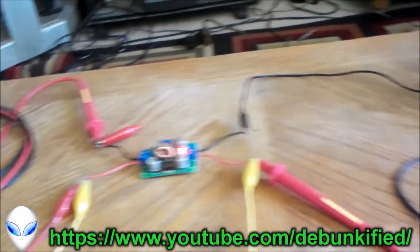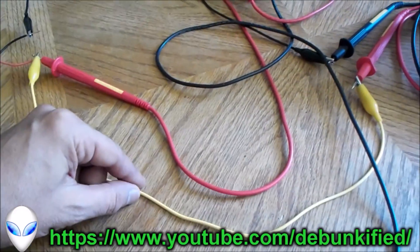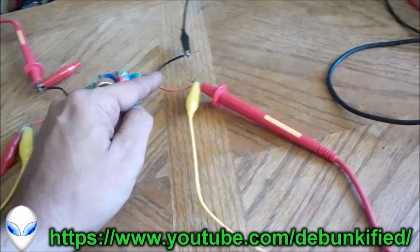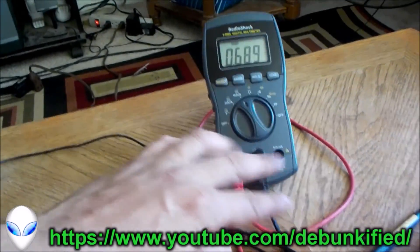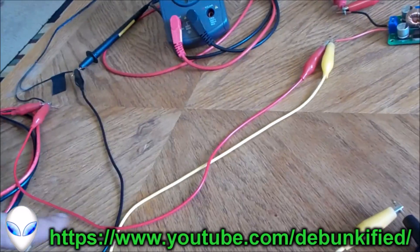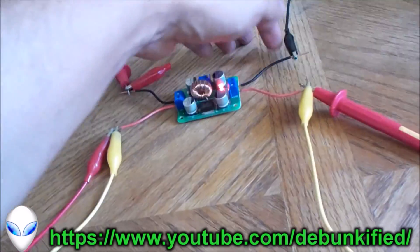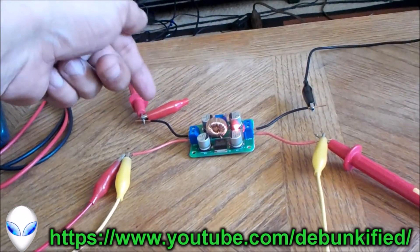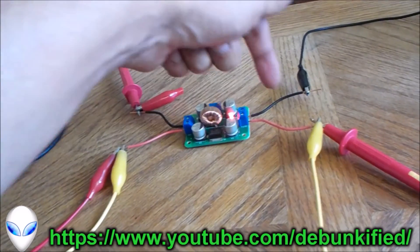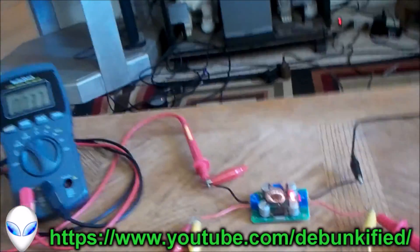So it's looped right now, and the same thing on the output except I'm measuring it on the positive side. The positive — I'm just reading the voltage here on that meter, right across it. Then on the positive side I've got the positive side of the meter reading current, and what's coming out of the meter is looped back into the positive side of our source. So the positive side is basically looped through the meter in between. Now the negative — I don't have a negative connected back to the negative because the negative is already connected internally inside of the circuit and inside of this converter. So there's no need to connect it; if I put a wire on the negative on both the output negative and the input negative it will make no difference because it's already connected inside.